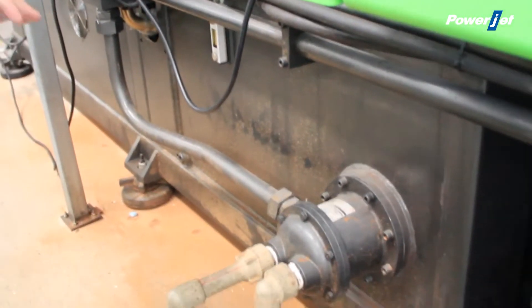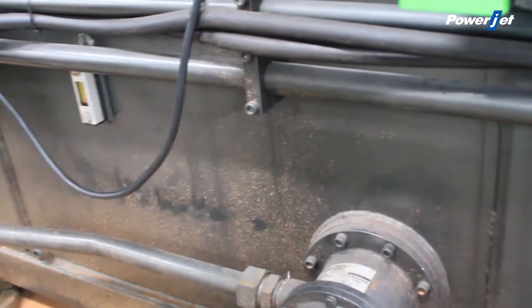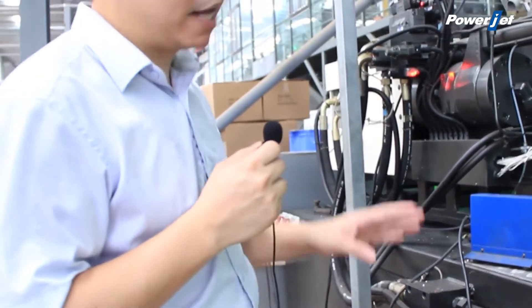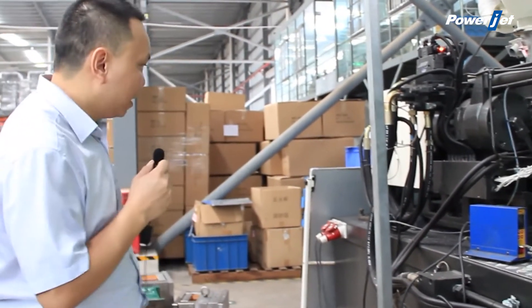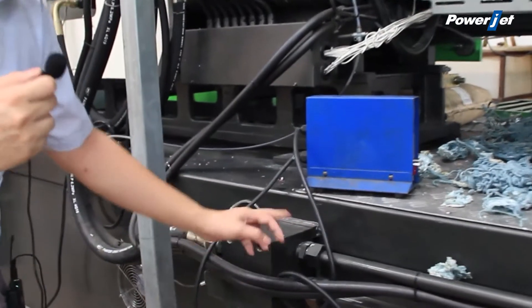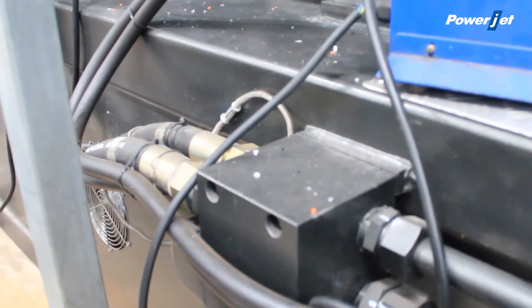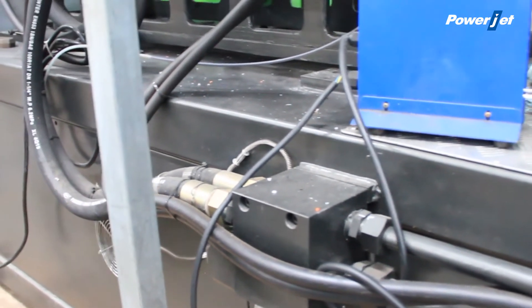Please take a look at this part — this is an oil cooler. In our normal standard machine, the oil cooler is just hanging outside of the machine along with the frame. But in our K2 machine, this is a built-in style. For our 300-ton and above K2 machines, all are built-in type for the oil cooler. We also have some detail improvements in the parts — we use standard parts to replace welding parts. As you know, welding parts are much easier for oil leakage to occur, so when we use standard parts, less oil leakage occurs.